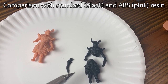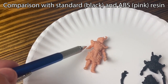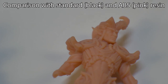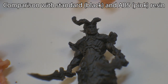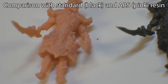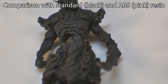It appears the Yusu iForm water washable resin cures harder than standard and ABS-like resin, which gives it extra durability with small items dropped at lower heights. It also offers the same amount of abrasion resistance as standard and ABS-like resin. I think this resin would be great for making durable miniatures and small functional parts that need to be rigid and not flexible.